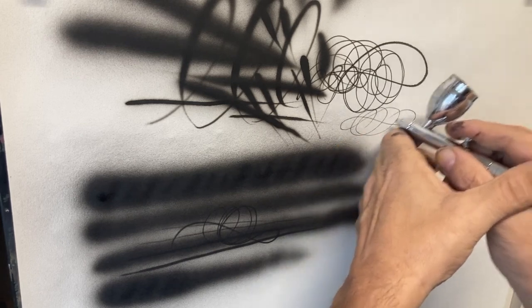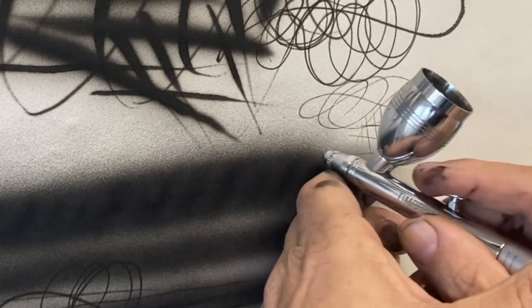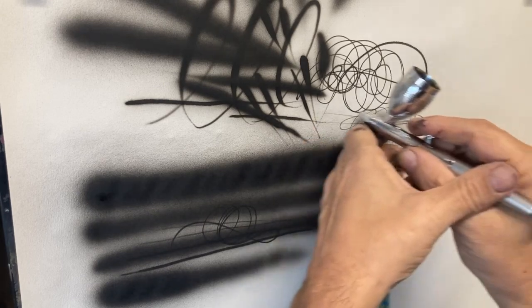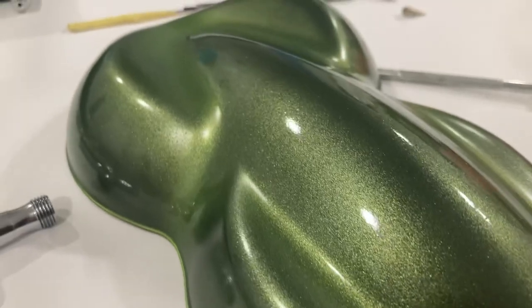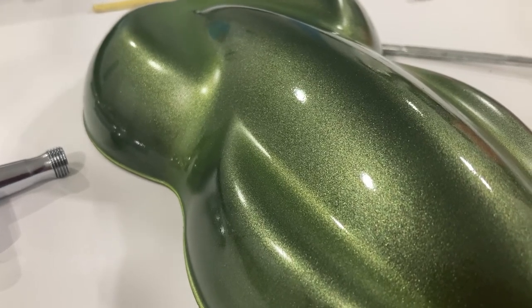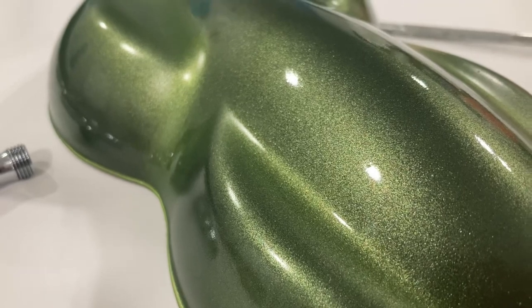I've moved over to the 0.3 needle and nozzle. I just want to show you guys you can really get in here pretty tight. The line quality of this is very good, bordering on excellent. I have absolutely no complaints about the thinness or the quality of the line I can produce with the 0.3 nozzle. And as I said I would show, that is what the speed shape looked like with the UVLS high gloss on it. I would like to, after it dries, probably do another coat on here, do a little bit of sanding to it — I see I got a little bit of trash in it, a couple of little dust nibs — and then do another coat on there and that thing would be pretty darn glassy.